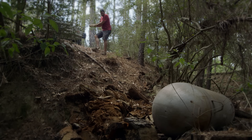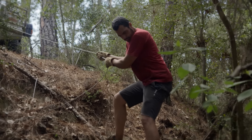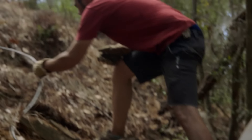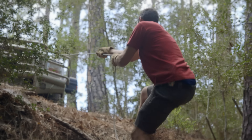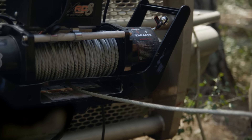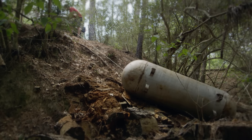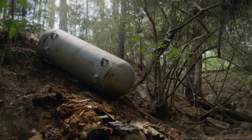A lot of people make barbecue cookers out of propane tanks. Once they don't hold pressure anymore, they pretty much just sit in a field or go to a landfill, so it's a great way to reuse something that's going to go to waste. The metal is really thick so it retains heat; they're a great shape for barbecue cookers. This one has a hemispherical head that I think is great for airflow, and they're easy to size.